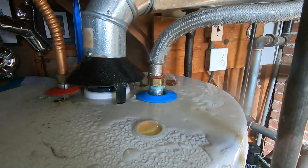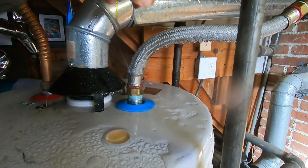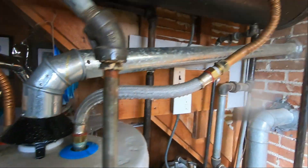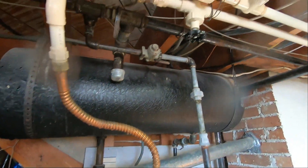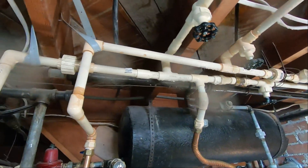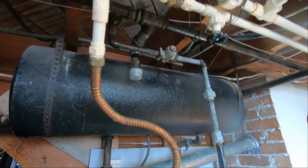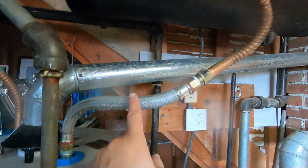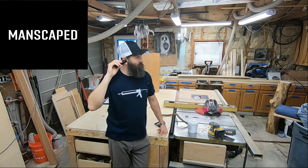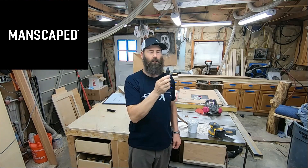You've seen them — they've got that braided stainless steel wiring over the rubber hose. You probably have them hooked up to your washing machine. This is what they're working with — a flexible water line. You can see the failure point right there. I just shut the water off. They've got a water shut-off right here. It's quite the CPVC system — they've got water shut-offs everywhere, which is kind of good, but we're going to replace this right now.